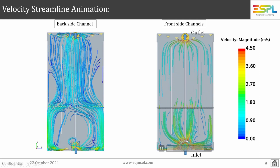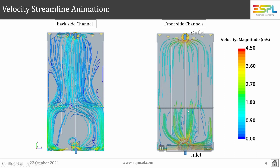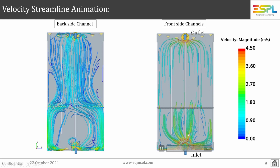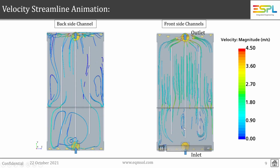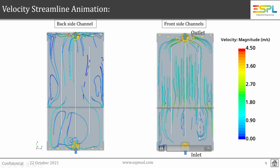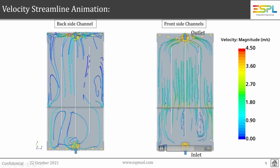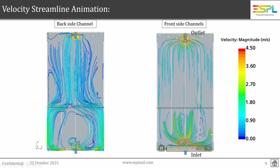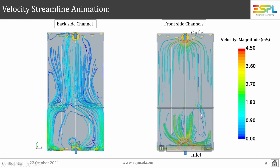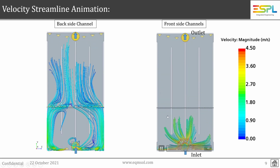But on this side, the fan position is so that it allows it to go right next to that, so there is no flow problem actually here. Shouldn't be. It's only in this simulation, so this swirl is not actually there if the fan is rotating, is my estimation. Here you can see again, the fan allows the air to go this way mostly, and it goes the easiest route, and then the baffling plate starts to divide the air evenly again, so it pulls the air towards that. Same on this side.